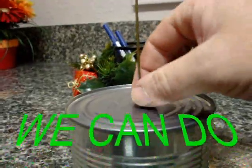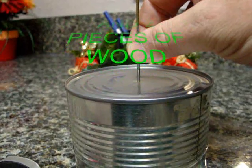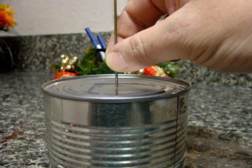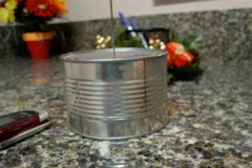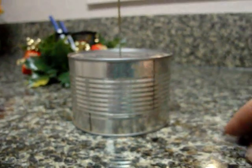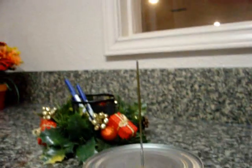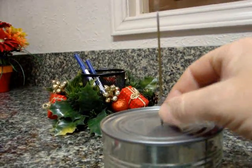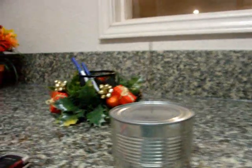If I grab this all the way at the bottom and lift the displacer until it comes up and touches that can, that distance right there is going to have to be split in half for the length of the shift on my cam later — we'll get into that. For right now, this is just showing you what's going to happen. I'll show you pressing this down and we'll show a couple other models that you don't even need to press for. After that we're going to put a piston right here or on the side, then put a flywheel. This extra length up here is going to get shortened down and have a small loop. Everything will come together as we go. I'm Scott Brown with Green Wind and Other Home Energies.